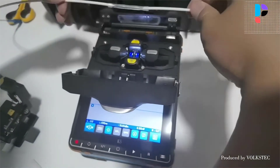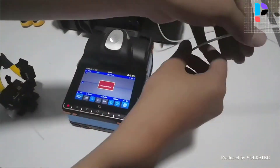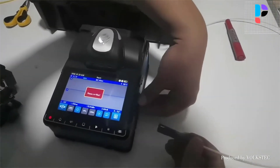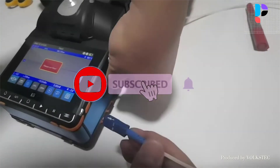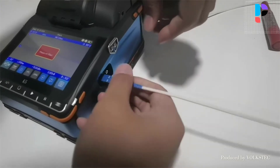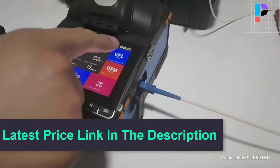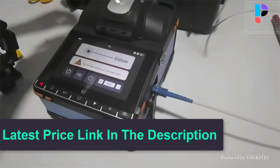Welding pause: after fiber alignment is completed, execution is suspended; press continue to proceed to the next step until welding is completed. Welding reminder: after the welding process is turned on, the status bar message prompt area will display text and error pop-up boxes will prompt accordingly.